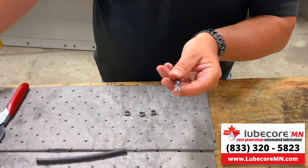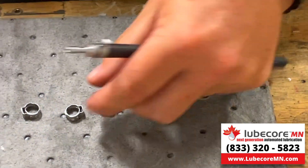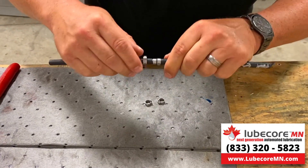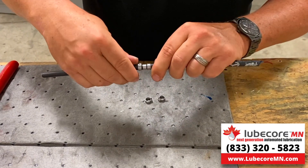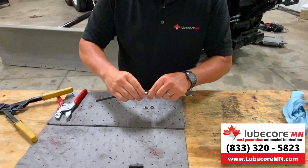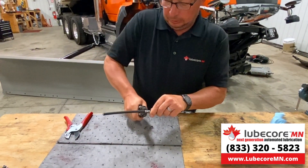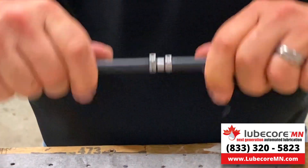When you're complete with the crimp, you should see that the ears are touching themselves. Then we basically insert the other end, push the crimp over, and then compress that as well — again using my PEX crimper. And that is one complete splice.